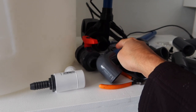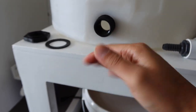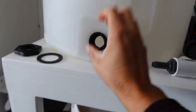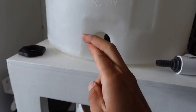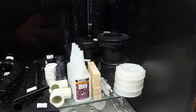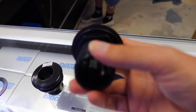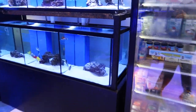If I do PVC — which I am going to do — I'd have to get an adapter, and it's already sticking out far enough. So the other option, which is what I'm going to do, is replace this with the standard bulkhead we're used to seeing in the aquarium industry — a slip-slip. I already have this one loosened up. Let's go to the LFS and hopefully they have it. And there you go — two one-inch slip on both sides, so I don't need an adapter.